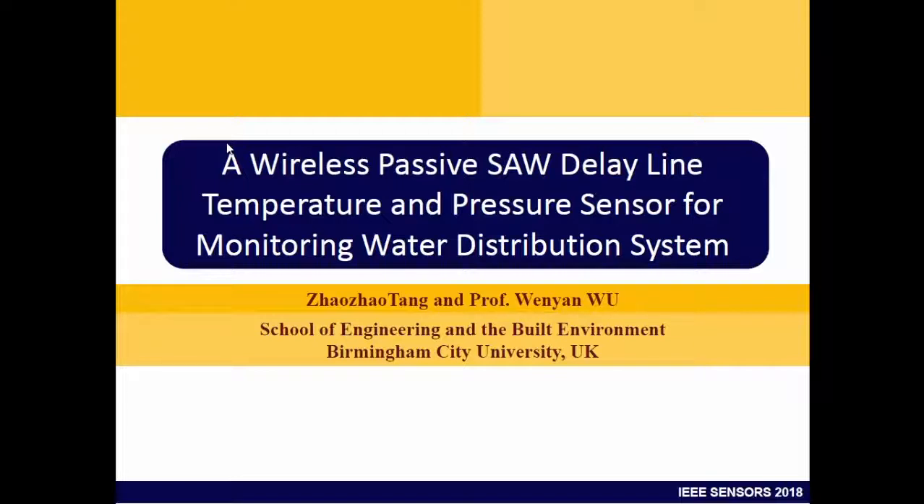That initiative led us to investigate what type of sensing system to use for the special water pipe. As the previous presenter mentioned, because the pipes are underground, the current situation is that sensor locations are deployed very sparsely — from a main hole you have main sensors collecting pressure data and water quality data. The water company aims to detect and monitor main pipe performance, leaks, or abnormal events, so they want more densely deployed sensors and continuous monitoring.